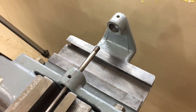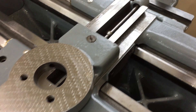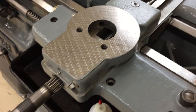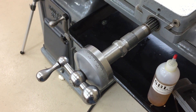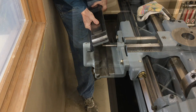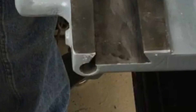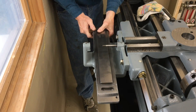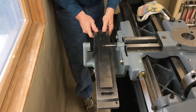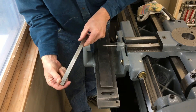Now that I have the bracket on, I'm going to back off that sleeve and then pull back on the cross-feed screw so we can assemble the rest of the taper attachment. Before I cover up the bracket, I want to show you where the bracket gib goes and the gib screw — it's tough to see this and I didn't get a very good photograph of it. Slide on the bed and the swivel that we put together earlier, and then put on the gib and the gib screw.